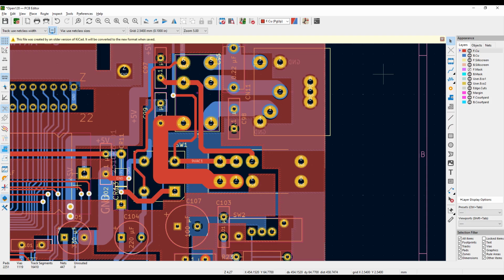Now, Johan has done something both crazy and incredibly useful. By analyzing original 128 mainboards, he's drafted a set of files that can be used to create brand new boards that are compatible with the originals. After a download of KiCad and a git clone later, I was able to easily trace where the various pads connected to, in order to jump each power switch pin to its nearest neighbor. Johan, you are awesome. So with this PCB layout in hand, I formed a new plan to get my machine back.